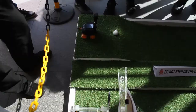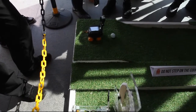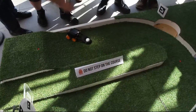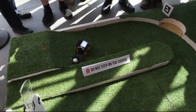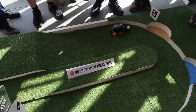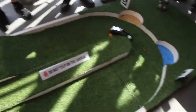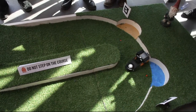The Golf Challenge was only finished at the last minute, so I didn't really expect much at the event. Again, lighting conditions were bad. It picked up the ball okay and drove towards the first marker all right. But at the bottom of the slope it falls over. Because it was done at the last minute I didn't have a recovery routine programmed in, so I had to manually take control and aim it at the marker again. Back in autonomous mode it drove towards the next marker okay, but because the approach speed was different it didn't stop in the same place and hit the corner.